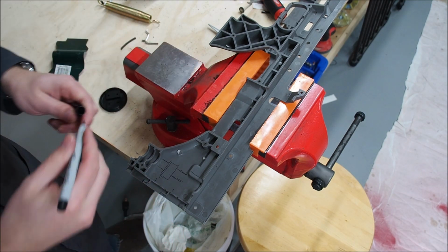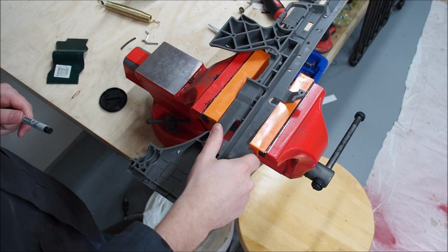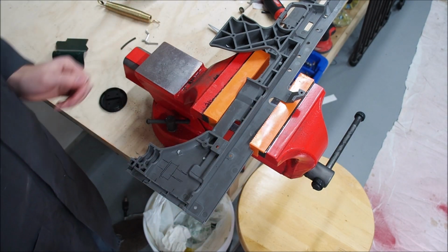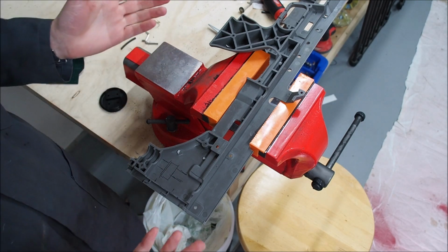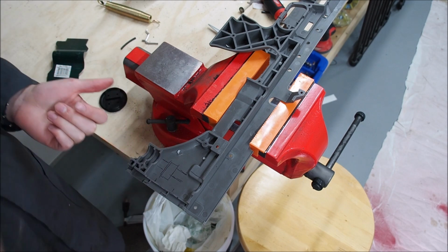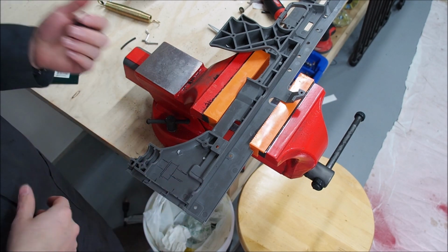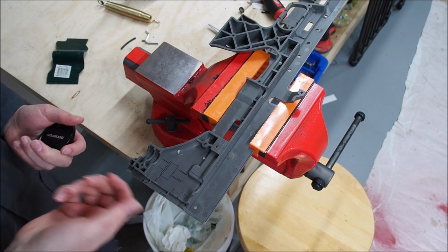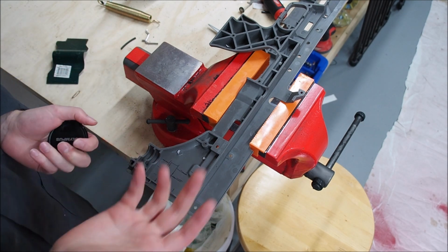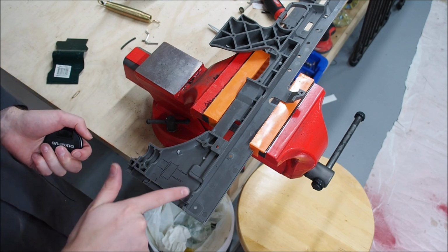I've got it clamped in the soft jaws of my vise, or with the soft jaw inserts. It's a bit of an awkward piece to hold. Another thing you should remember when working with this stuff: wear a face mask or a respirator, or work in a well-ventilated area so you don't get the plastic dust. Always wear safety glasses so you don't get this stuff in your eyes. I might actually go in and clean up some of this other stuff too, but yeah.